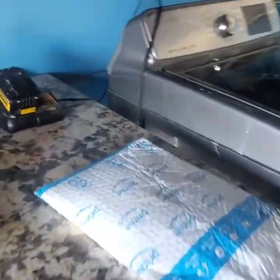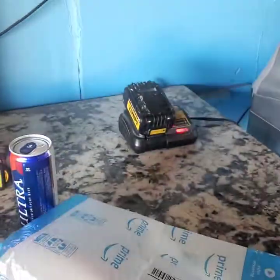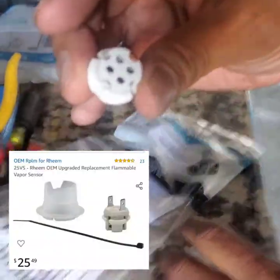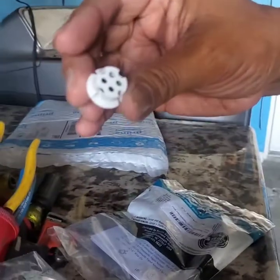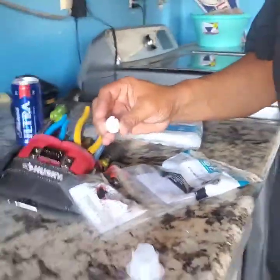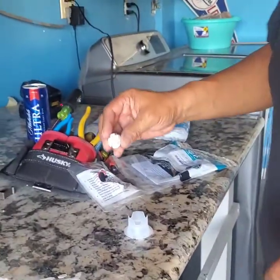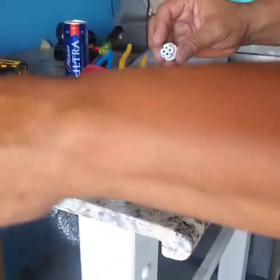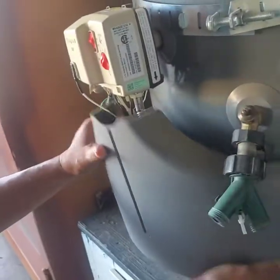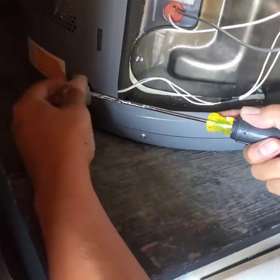I picked one up from Amazon — it's right here. This sensor is very sensitive; it's placed here for safety reasons. If it detects any flammable vapors like gasoline, paint thinners, or paint, it will shut your gas valve down. Mine got real dirty, I had to reset my water heater a few times, and now it won't reset, so it's time to replace it.